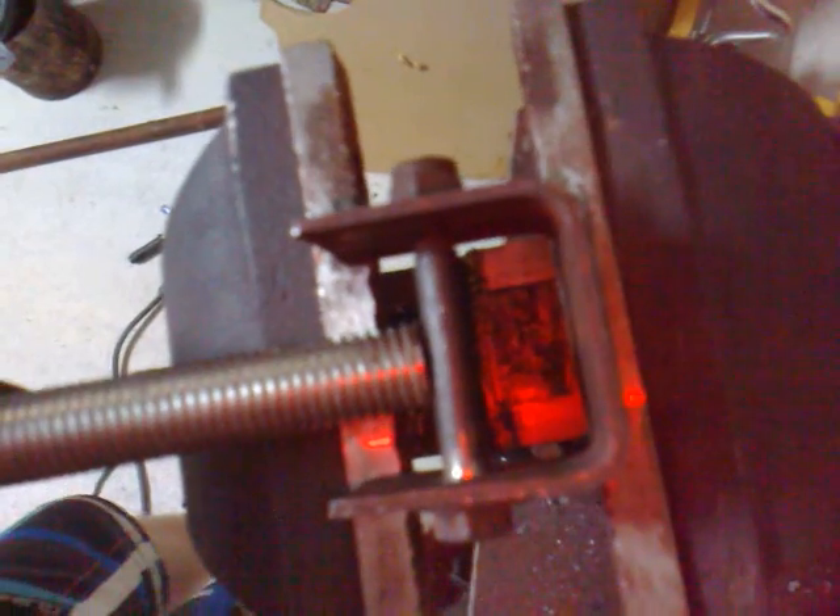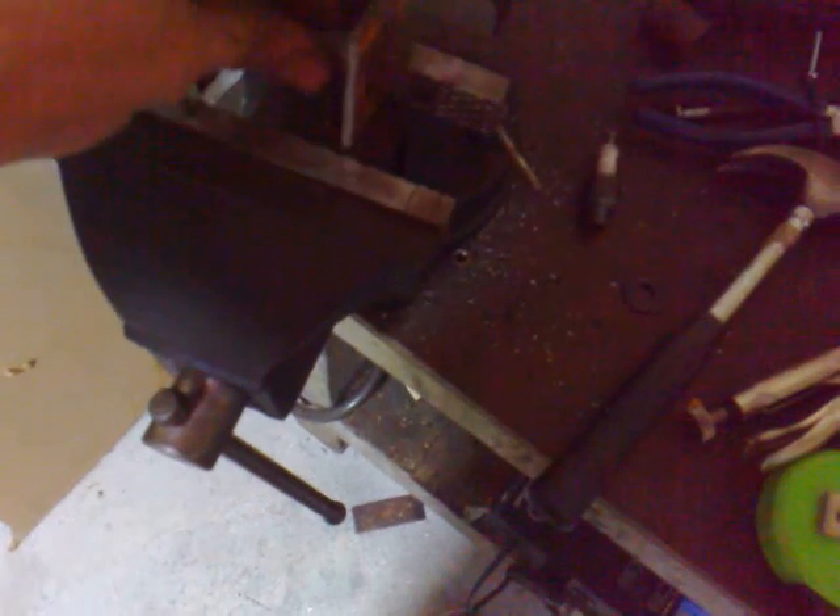I'm not going to put a tube through this because I don't have any tube laying around that will fit over it, so I'm just going to weld the threaded rod directly to this bolt. I'll just chamfer it a little bit — it won't be quite as good but hopefully it'll be good enough. I'm going to cut some threaded rod and put that on. It's pretty loose, and if it stiffens up a bit then some CRC will fix that.